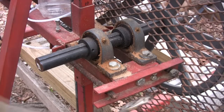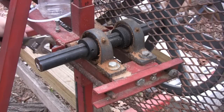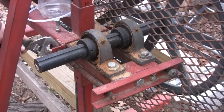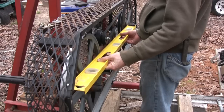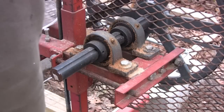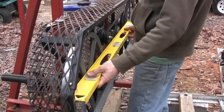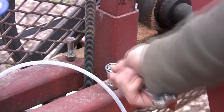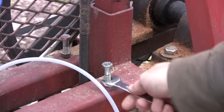The way I adjust the tension on the blade is a little difficult — it involves two screws. One turns one direction and the other the opposite direction, so I can tighten it and adjust the axle at the same time to make sure they're parallel and the wheels are in the same plane. I adjust it one way and then the other to manage both tension and shaft axis simultaneously. When it's all tightened up, I use the set screws to hold it in place.